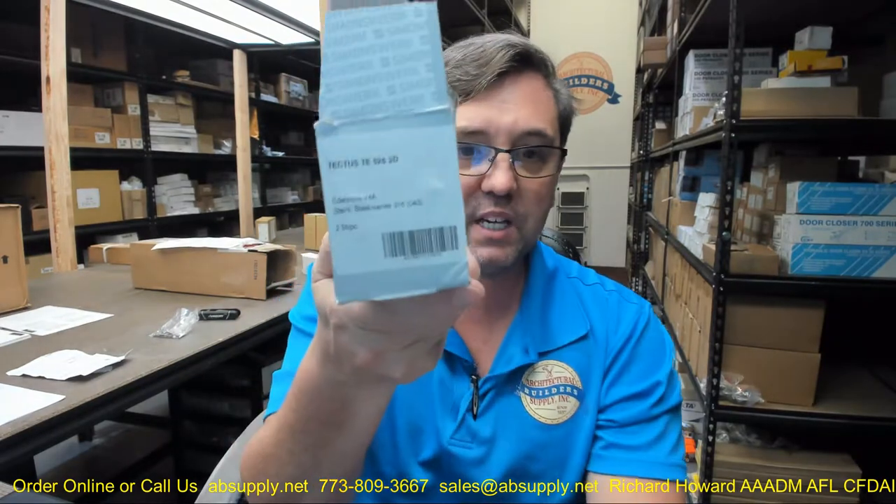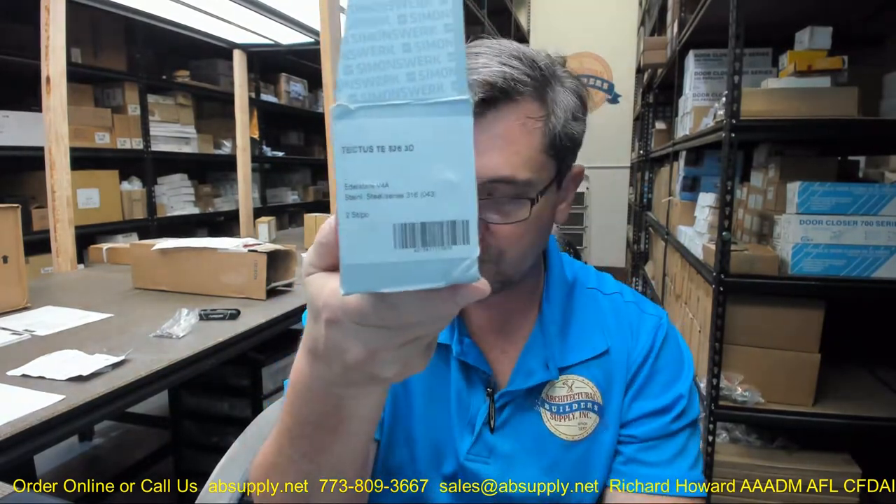When using overhead stops, you must notify the overhead stop manufacturer that you're using Tectus TE526, because they're going to provide — probably at an upcharge — a template that positions the stop correctly, which is not the same as with a butt hinge. You sure don't want to use the wrong template when installing this material. Outside of that, most of these hinges are generally in stock, but 316 is made to order. This order took the factory originally quoted six weeks, then came back and said ten weeks — ultimately got them to us in seven weeks. Permit ample time, because without hinges you're not going to hang your doors. Finally, there's a link below this video to the manufacturer's page for all Tectus products. If you have any questions on the Tectus TE526 3D in 316 stainless or any other Tectus Simonswerk product, please feel free to reach out to us. Thank you.